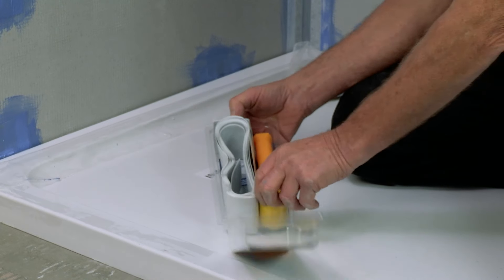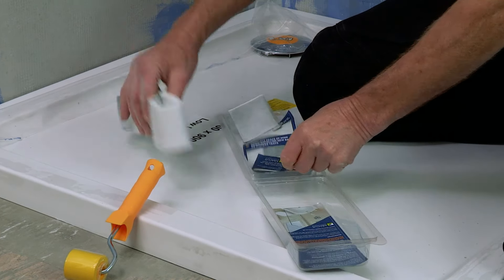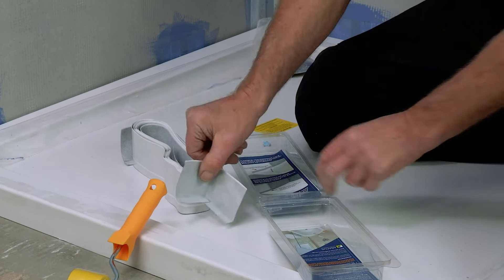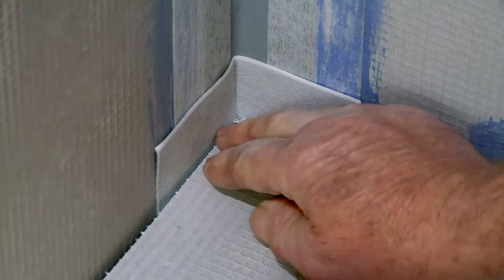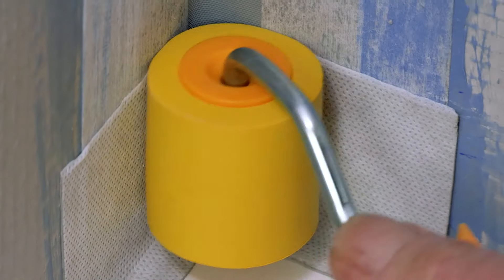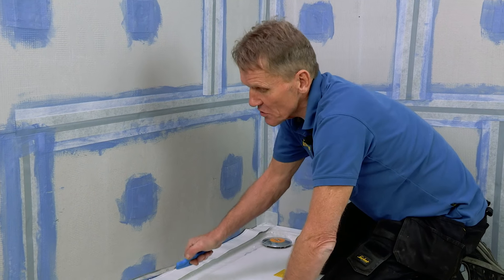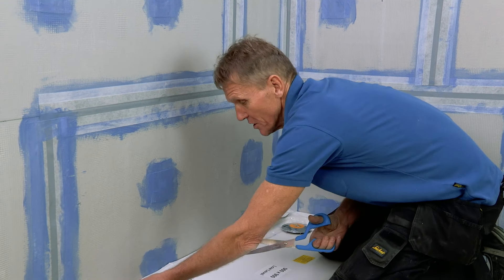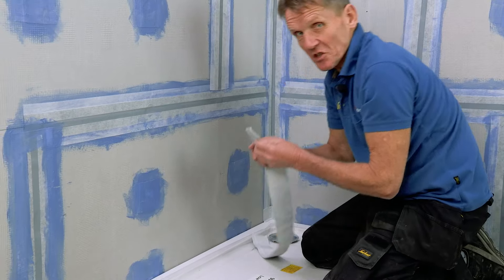That is the perfect surface for sticking this tape onto, and I just need the two-metre kit. In the kit we've got a roller — which you'll see is very important — we've also got the tape, a preformed corner, and of course the instructions. I need to cut this tape to length; it needs a 20-millimetre overlap over the corner and also at the other end. If you're putting a shower screen in, the tiles always have to go behind the shower screen as well — something I see people get wrong, tiling up to the screen rather than behind it.